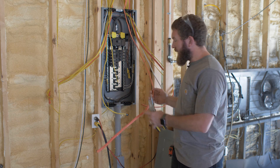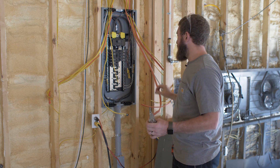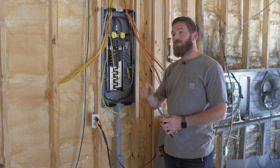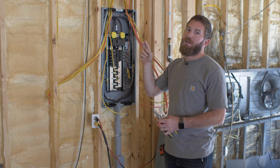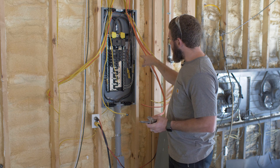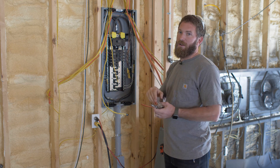We're in the process of wiring up this panel, and we've already gotten the wire ran over to the outside to the disconnect that's outside. Now we have to tie it into the panel. I've got a 30-amp breaker that I'm going to be plugging in. Since the outdoor unit is 220, that means it has two hot wires — two 110 hot wires combined make 220. We are going to be using a double pole breaker, tying in the two hots into the breaker, the ground into the ground bar, and the common into the common. However, we're not going to be using a common wire for this application, so it'll just be wire-nutted off at the other end.